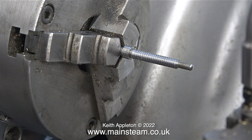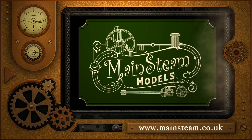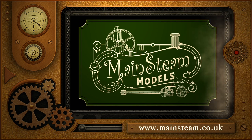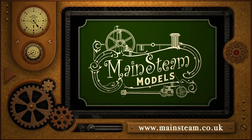It's a much coarser thread than I would normally use — it's 24 threads per inch, and I think the coarsest one I would normally work with is 26 threads per inch. In the next episode I will be making a fitting to go in this part, and the fitting will also be threaded 24 threads per inch to match the one on the shaft. That's it for this episode — stay healthy, thanks for watching, and I hope you found it useful. Please take the time to visit my main steam models website, click on the section that says video playlists, and by doing that you can find other videos that you may like to watch and watch them back to back.